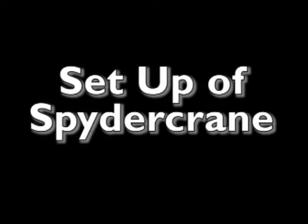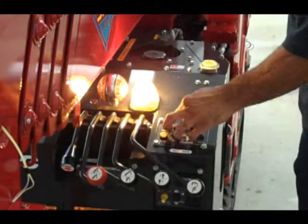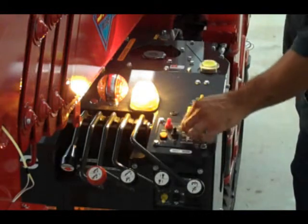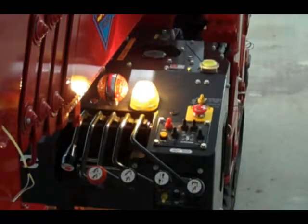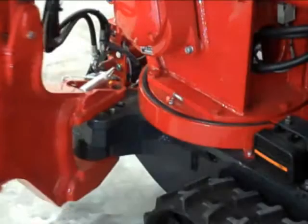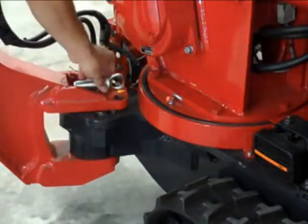After selecting outrigger mode, you will hear a bell sound, voice command, and the amber light will illuminate to let you know you are in outrigger mode. Outrigger mode. Outriggers moving. Begin by removing the stow pin and rotating each outrigger leg to your desired position.